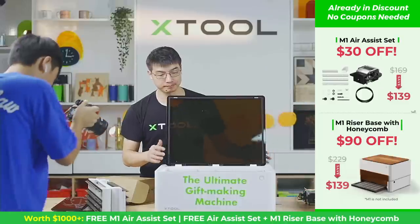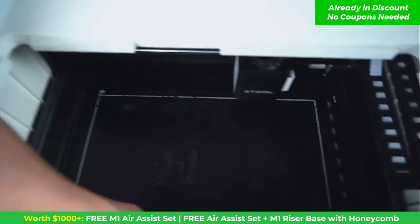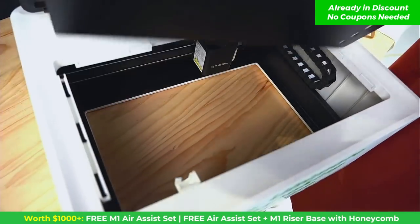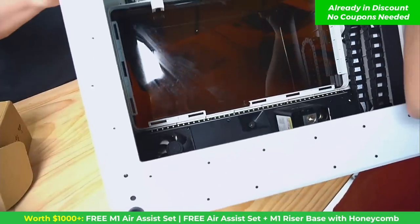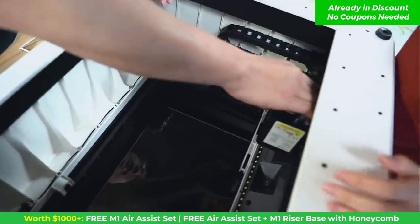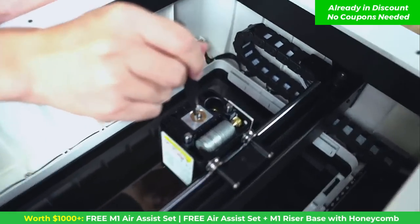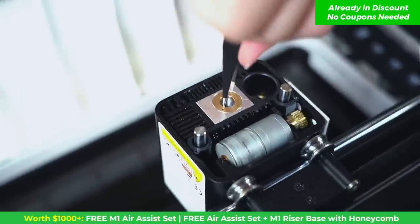So in order to install the air assist set, first take out the bottom plate from the bottom. Take it away. Close the lid and turn it over. It's not like xTool D1, where it's very easy to mount the accessories. For M1, you need some work to do, but it's not that hard. Here we see these things. The tweezer is for changing the lens mount. There are two small holes here, so we use the tweezer to loosen this lens mount.